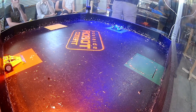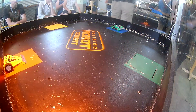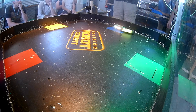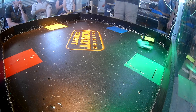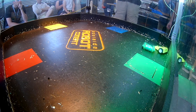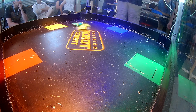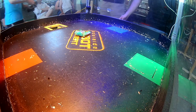This is the second fight. I tried to re-tighten the brushless motor mount and glued the silicon wheels onto the hubs, and things started off a lot better. I still had the issue that the drum kept hitting the ground, and I didn't tighten that brushless motor up enough because the drum again stopped moving — so I was out of weapon. Also, because of the change, the wheels are a little bit too far back and not getting enough traction since all the weight is forwards. Unfortunately, my opponent goes down the pit just as it opens.